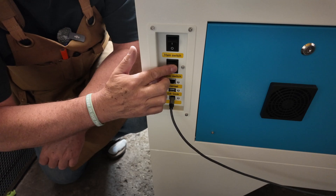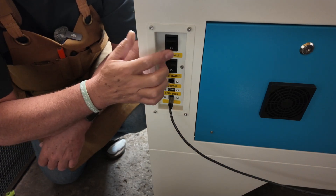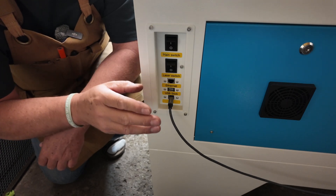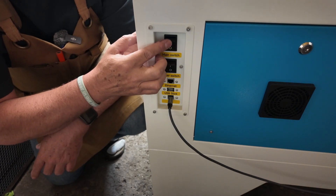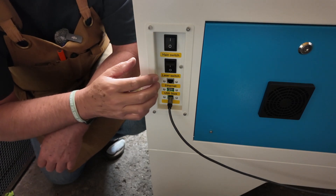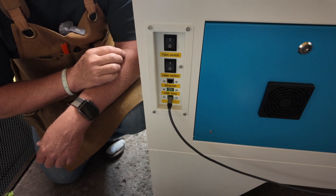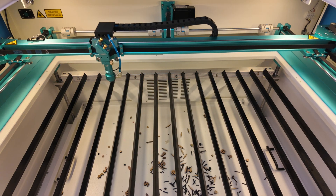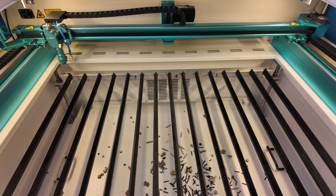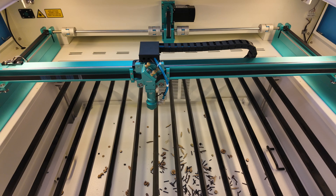This Nova Plus series has two power switches. One is marked main and the other is marked laser switch. Your manual always tells you to turn the main power on first, then turn on the laser. When you're finished at the end of the day, you do it in reverse — shut off the laser first, then shut off power to the machine. So we're starting up — I'm going to hit main. You're going to hear a beeping, which is telling you the laser hasn't been turned on yet. Now that the machine's powered up, I can safely turn the laser on and the beeping stops. When you hit that main power switch it's going to light up, the machine is going to home the laser head to the corner, complete its initialization, and then return the laser head to wherever the last origin you set was. It has a memory — it remembers what you did yesterday. Now the beeping stops and the laser is engaged. Everything is ready to go.